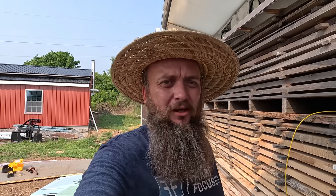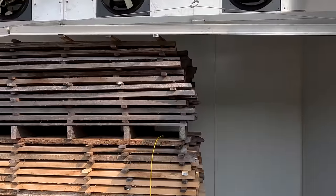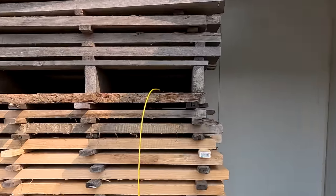If I let this lumber sit out here and air dry for a complete year, it's not going to get any drier than 17%, maybe 15% in winter when it gets really dry, but that's as dry as it's going to get. So letting stuff air dry a year per inch is not really accurate at all. It will air dry until it gets to the EMC for the environment, and then it pretty much stalls out, and that's as dry as it's going to get, unless you take it inside of a house and finish off drying like we were talking about, or you put it into a kiln and properly dry it down to 8% or 6%, whatever you like. So now that we've cleared that up, let me talk about these moisture cables right here.